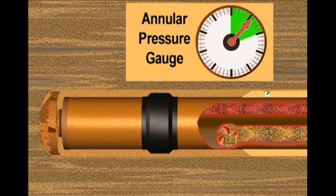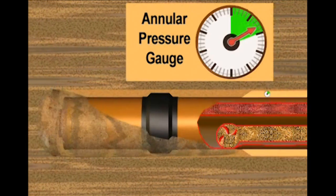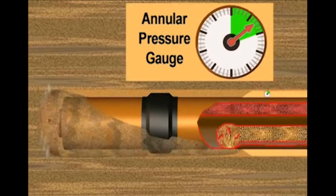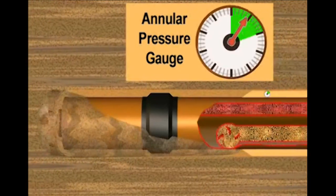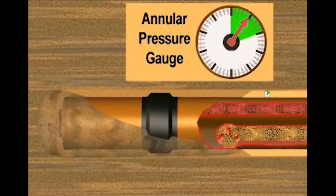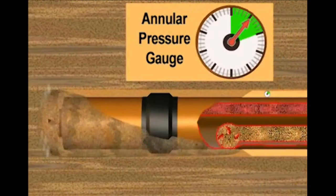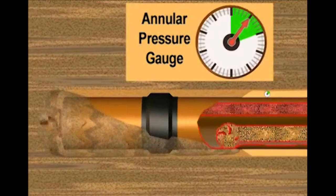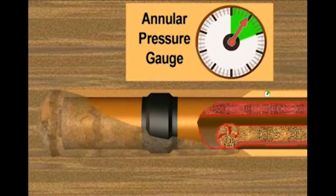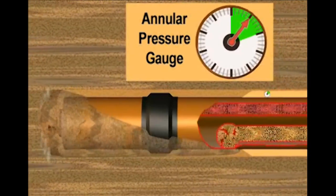As the drilling fluid is pumped through the drill head, the annular pressure increases slightly until the suction pump is started. Once the suction pump is started, the annular pressure returns to approximately the static pressure. The bentonite supply pump and the suction pump are synchronized at the surface by monitoring the annular pressure with sensors within the drilling module. Controlling and balancing the static pressure ensures that pressure does not build within the annular space, causing fracturing during drilling.